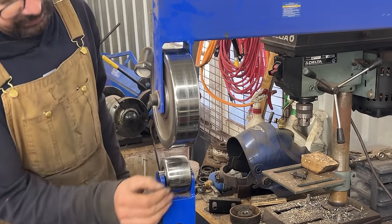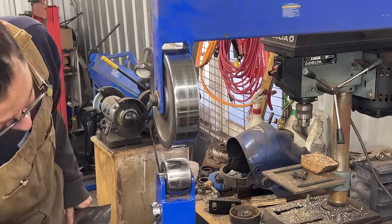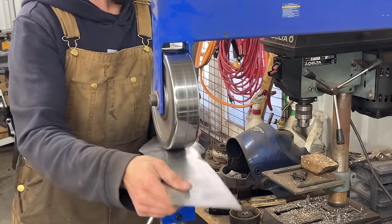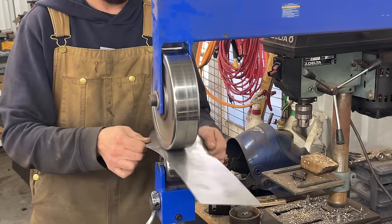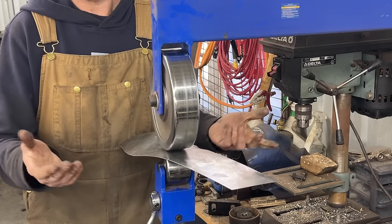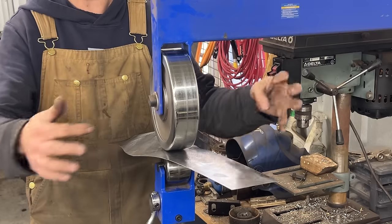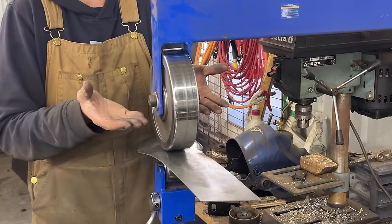Okay, so you see this is the smaller crown. Like until now we had this one, and now we're gonna continue with this one. With a little pressure. We don't want the edges stretched, because if we stretch them, we're basically stretching the whole piece, which doesn't give us the volume. It gives us more area for the entire piece. We want to stretch only the middle part without stretching the edges, and that's gonna raise the center only.